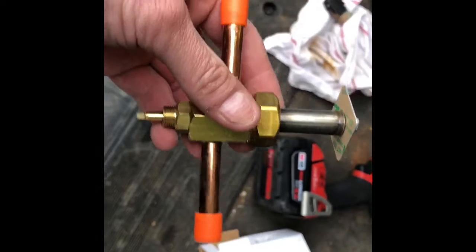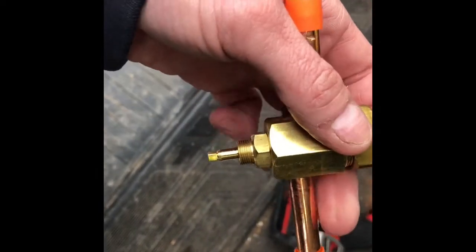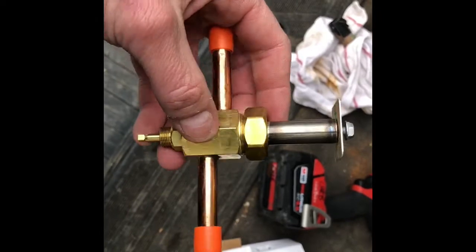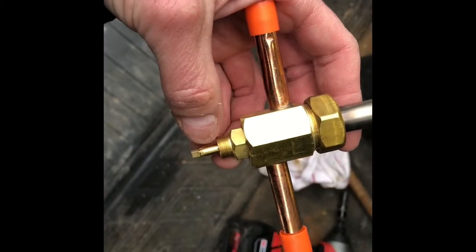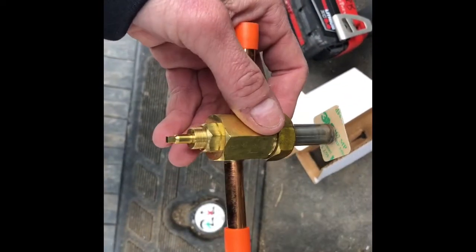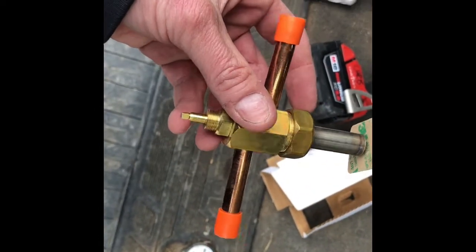I'll change this out and put a new coil on it as well. I wanted to point out, on a new solenoid valve — which I'm sure most of you know, but some may not — you've got to pay attention. See where that says 'in'? These valves are directional. You can't go backwards, they won't work right. They'll either block up or just won't work at all. Also, these ones that have this little stem here, always make sure that is wound all the way out counterclockwise. If that's in even a bit, it can keep this valve open.